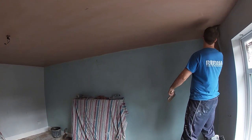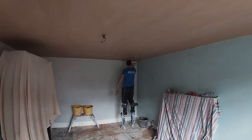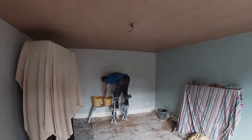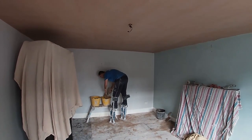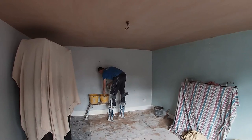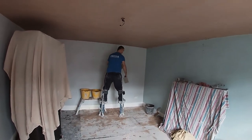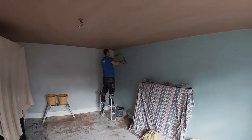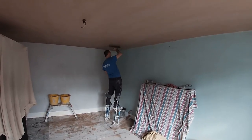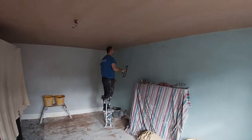Just wet the blade down and give it a quick light polish — you don't have to shine it right up, just a quick once over. I always use these trowels when the ceiling is practically finished, just for that last final look around to make sure there's no holes or wee scratches. Obviously if there is a wee stone that moves at this stage, that is the most annoying thing to ever happen, but it could happen with any trowel. Nearly finished here — just pull out this angle and then it's really just clean-up time. So far so good with this trowel.